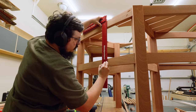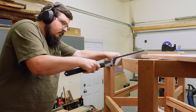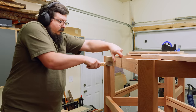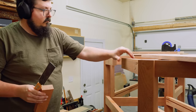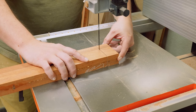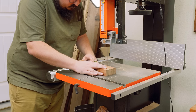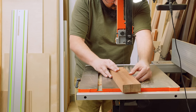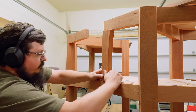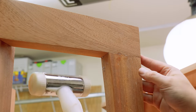From there it was on to notching the upper rear rail — this is going to be one of those things dependent on the type of Kamado you have. Since I have that spring-assisted lift on the back of mine I need to notch this out, but if you don't have it you don't really have to worry about it. I first mark out my upper and lower rail using a square, then use my pull saw to notch out the top. Running low on lumber, I ended up having to laminate two offcuts to get to my final thickness for the braces. Once I marked the curve and trimmed everything down I used my drawing bow to mark out the decorative curve, then trimmed them out at the bandsaw and popped them in place — looking for a snug fit but not so tight it lifts the rail off the lower rail.